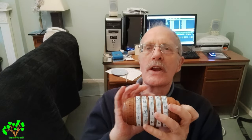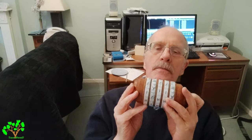I've used in the video quite cheap timber, which is mahogany. I thought if I can use cheap timber, then hopefully anybody can do it, because ideally you want hard timbers when it's a precise item. So you want precise diameters and precise faces that are flat and square, so that when they come together, there's no gaps between mating components. But I've used soft mahogany and it's turned out okay.